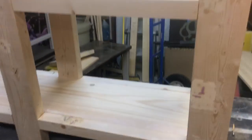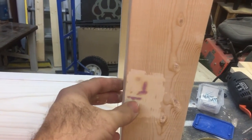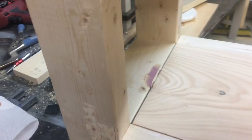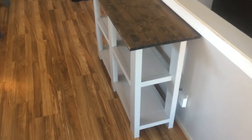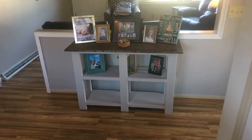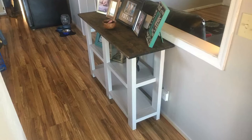Since this wood is so rough, I went back and put putty in all the bad spots. The putty I use is made by Elmer's - it goes on purple and when it dries it turns to the natural wood color. It's so cold out here it's going to take a while to dry, so I'm going to let it dry then go back and sand it smooth. There's the finished product after the stain and the paint. If you like the video, give me a thumbs up and subscribe. If you've got any questions, shoot me a comment and I'll get back to you - have a nice day!